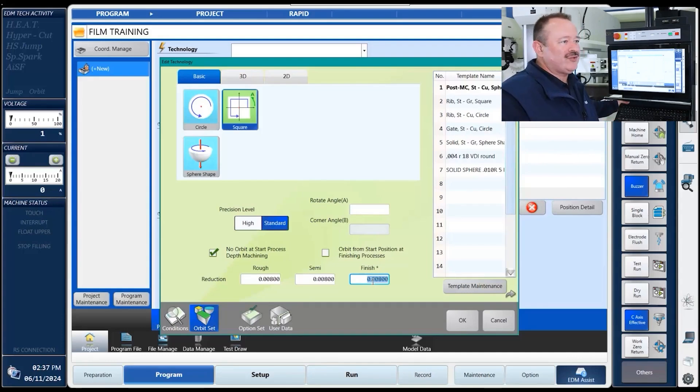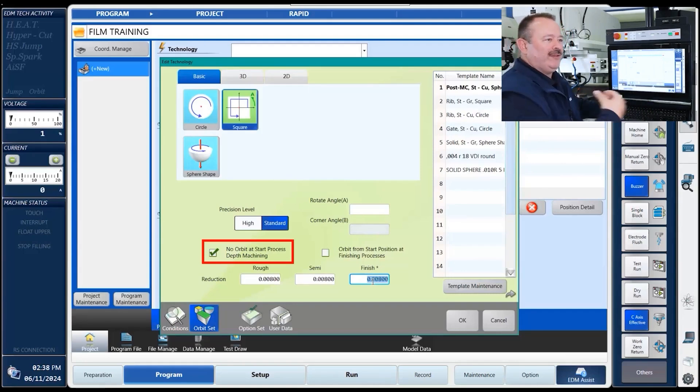Also, if your max corner radius is really large — say 15 or 14 — it doesn't really matter. The bigger you can make that reduction, the faster we can make this burn and the more material we can get out. So we want to try to achieve the most reduction that we can. Another thing — this checkbox here tells it that I don't want to orbit the whole time I'm roughing into it. I just want to plunge in as fast as I can into the side. Once it gets to the depth I've told it to reach, then it will start orbiting out. That's going to burn a little faster, so checking that box activates that.